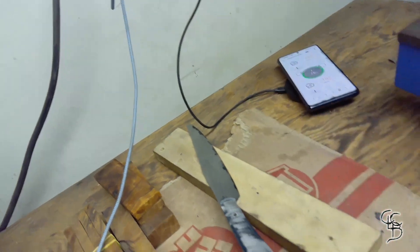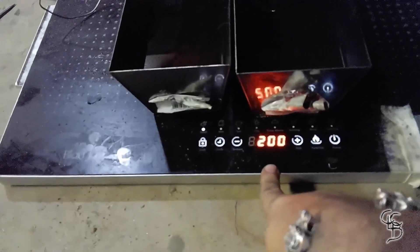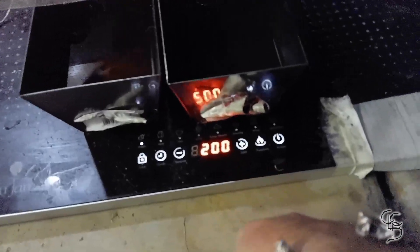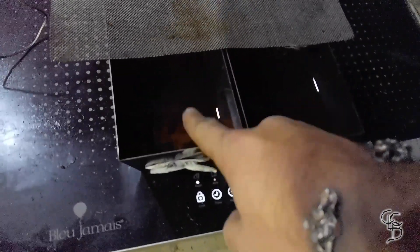118 to 122 — that's the range; too cold and too hot outside of that. I have painting troughs that are stainless steel and a food warming plate rated up to 210 degrees, set at 200 until we get close to temperature. The Inkbird probe is floating in the oil — not resting on the bottom, because that will give you a false reading.